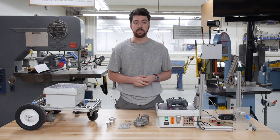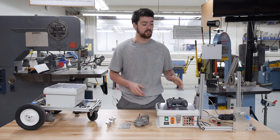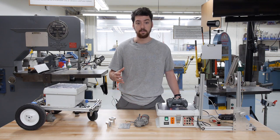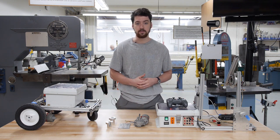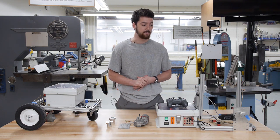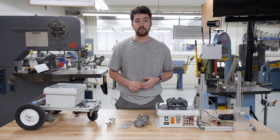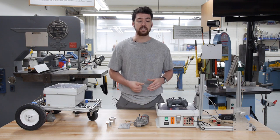Groups will accomplish the given task using assorted motors provided by the lab. These motors are going to provide the movement or power for any moving part of your robot, from drive wheels to release gate mechanisms, grippers, basically anything that moves. Make sure to choose each motor relative to its given function on your robot, as each one has different rated speeds and torques.